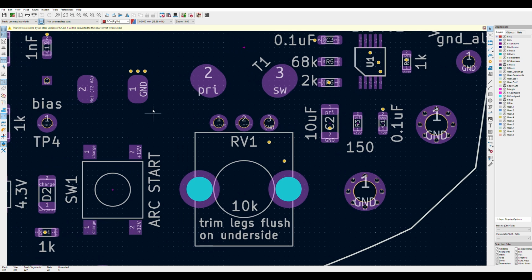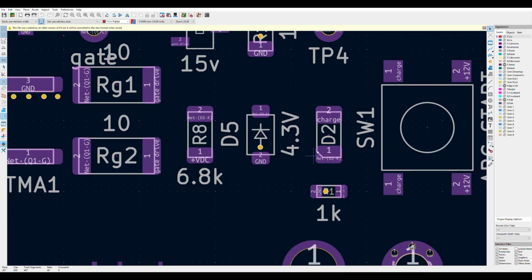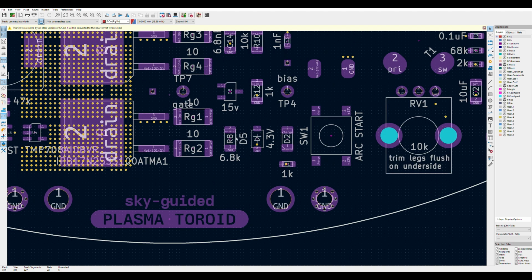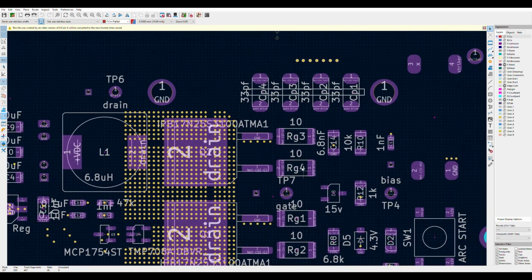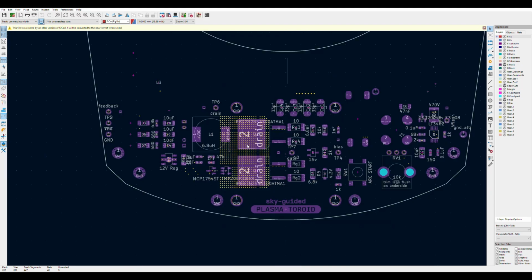And if I also look at diodes, this is also apparent. The diodes, for instance D2, we can see what pin 1 is, and we can also see that similar shape, that 45-degree angle being on the bottom. Some of the other diodes, they'll have this symbol instead, so it's helpful to understand the direction it needs to go. With that, I think I can find the designators in this layout, and I can start mounting components.